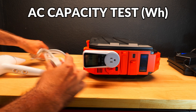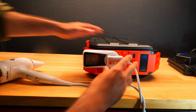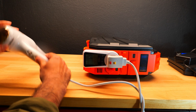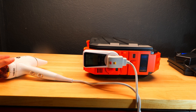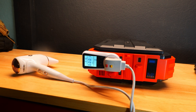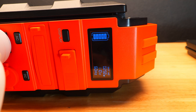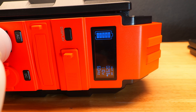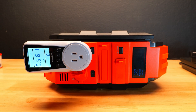With the battery charged back up, we're going to perform a capacity test to see how close we can get to the 614 watt hour stated capacity. We plugged in a power meter and ran the AC output at around 300 watts — roughly half of the 600 continuous watts it's rated for. When the battery drained, the power meter read around 567 watt hours, which is 92% of what the power station claimed. That's really good — actually better than most other power stations we've tested on the channel.